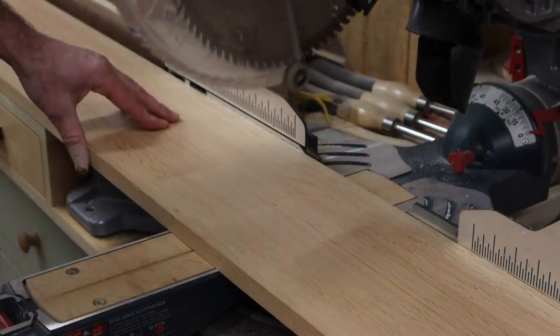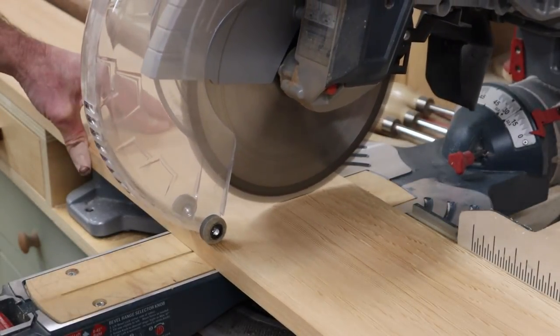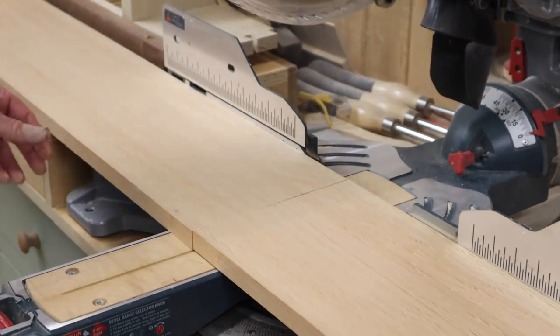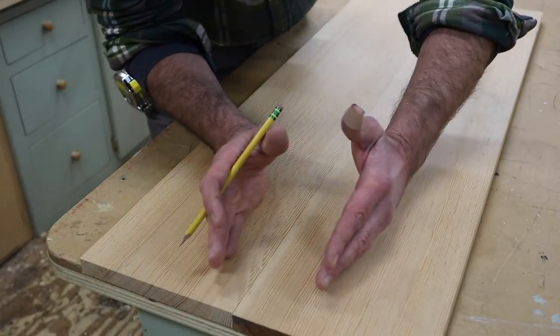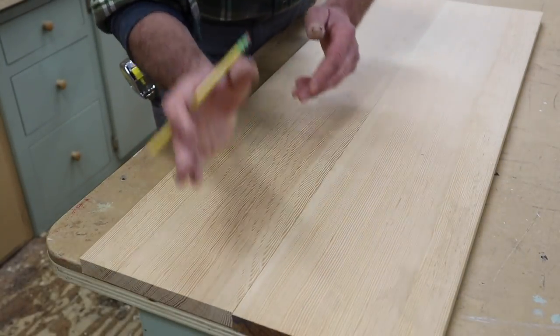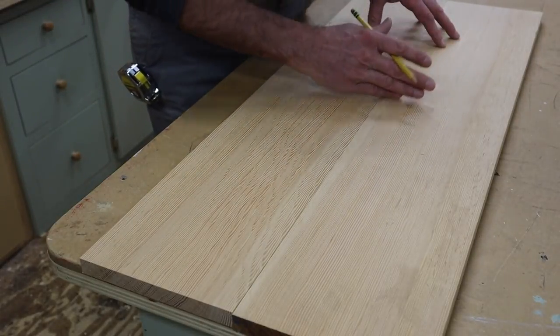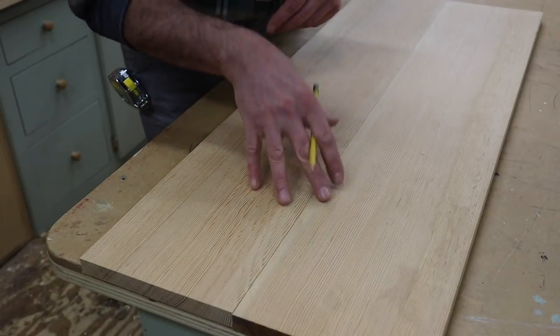I had one board left over from the sofa table project, and I'm starting this build by cutting that board in half and joining it back together. I'm joining the boards at the sapwood, and that should make the seam disappear once the boards are clamped together. I'm also being really careful where I place the biscuits. Since this board is going to be cut into four parts to create a box, I don't want to expose the biscuits when cross-cutting the board.